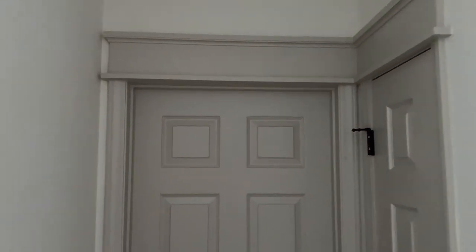In case you're wondering what I did with this little nook here, I ended up just butting the edges of both trim pieces together to look like one continuous piece. And there you have it — a relatively easy update for your interior door trim that can probably be completed in a weekend, especially if you're doing a small space with only a few doors and windows. By keeping the vertical trim original, we saved on material, demo, work time, and waste.